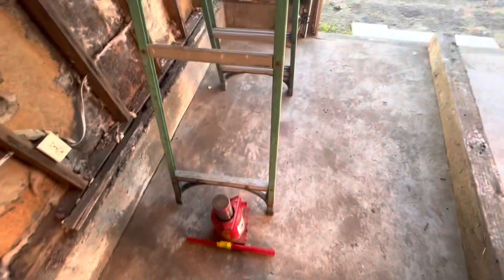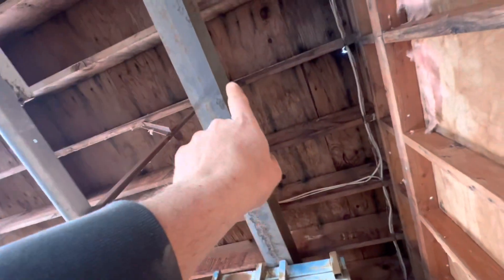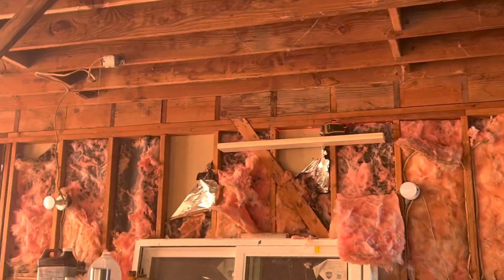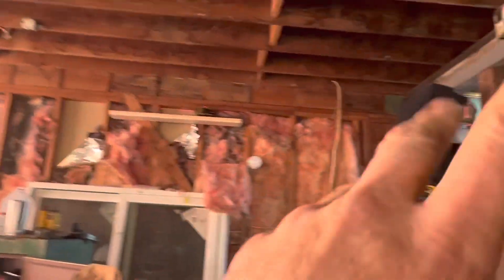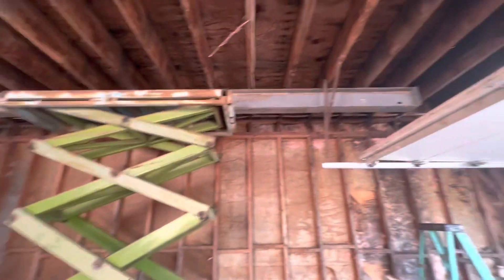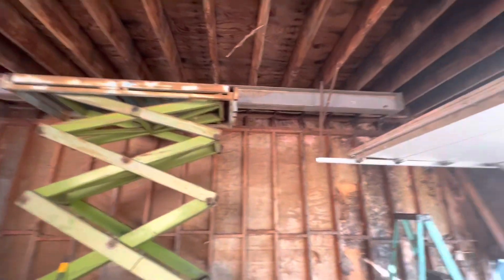Getting some layout on the floor with the laser. Kind of hard to spot the string line, but we got that — a string line and chalk line up on the ceiling. Laser's out, making sure the heights match. Doing everything as correctly as a mechanic and a millwright could do it.